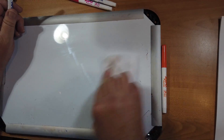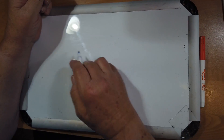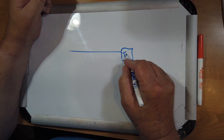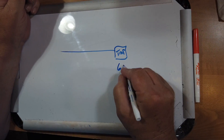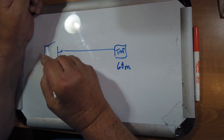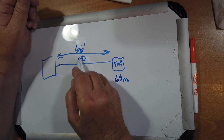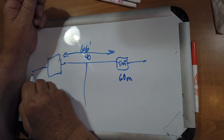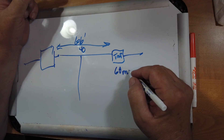Now, if you wanted to do it as a multi-band type antenna, you would put a trap that is tuned for 60 meters instead of 20 meters or whatever — a 60-meter trap. This distance here is 66 feet for the 40-meter antenna. There's your coax, and then there's a stub coming out of here that will bring the antenna into tune for 60 meters as well.